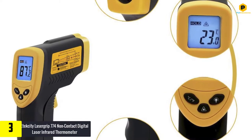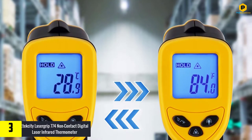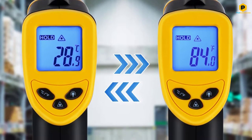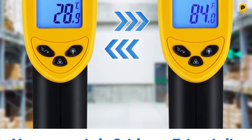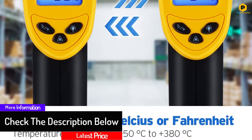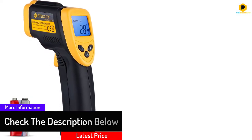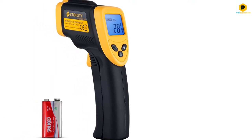It is a Class II laser temperature gun that can measure temperatures of between minus 58 degrees Fahrenheit to 716 degrees Fahrenheit, minus 50 degrees Celsius to 380 degrees Celsius. It has a distance to spot ratio of 12:1, which means you can measure temperatures from a significant distance away. 14.1 inches or 36 centimeters is the ideal distance between the laser temperature gun and object for best accuracy.